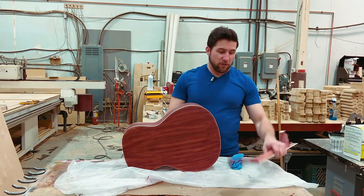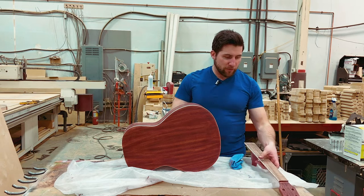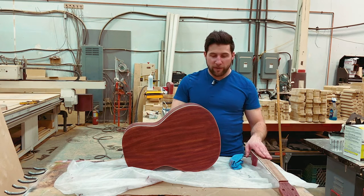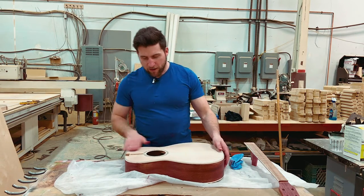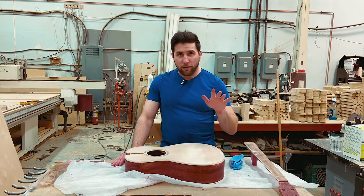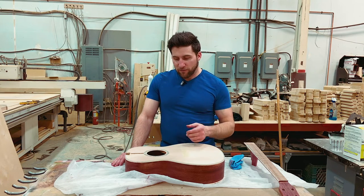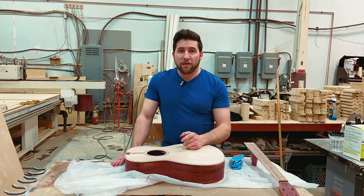Neck looks good too. We got some nice color on there. And so I'll probably tint the fretboard, because I've got a lot of questions recently about putting color on the fretboard. But the next thing that we're going to do on this guy before we do our mock-up, glue up and all of that, is we're going to grain fill the front. And for that, I want to keep it light. I want my final product to have a light amber and everything. So I'm not going to use a tinted filler on the front. Instead, I'm going to use an epoxy. Stay tuned. That will be in the next video.